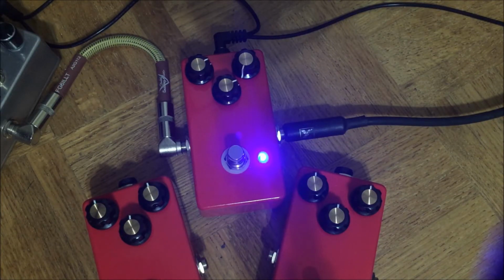Yeah, the inside of the pedal has a trim pot. I have it set for 4.5 volts on the MOSFET device, but you can play around with it for a larger bias voltage, or you can starve the voltage so that you get a spittier Velcro-type fuzz sound. Otherwise, I would just leave it as it is for the most part. I have it marked with Sharpie in case you forget the position it was in, but you can play around with it if you want, and if the marker wears off, just use a Sharpie or something.